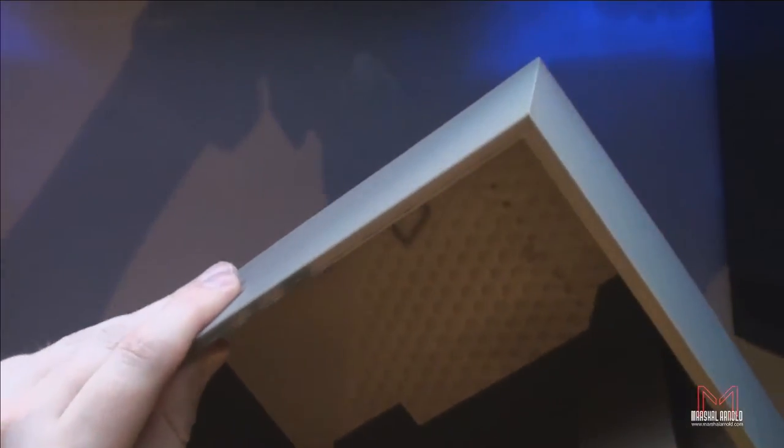The other thing was the overall size of these parts came out small. The overall size of the pocket that the push would sit in was actually undersized by about 0.01 of an inch. You can see here, this pocket idea was awful because the edges start pulling away. And I just wasn't too happy with that. All right, so that pocket was undersized when I printed those out.